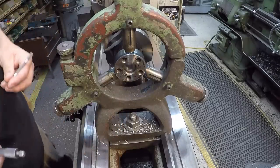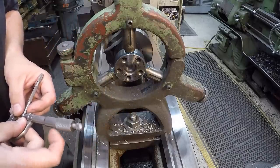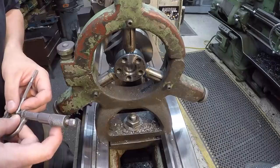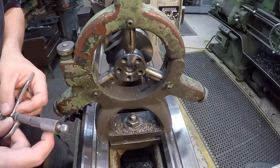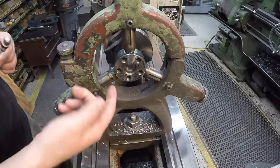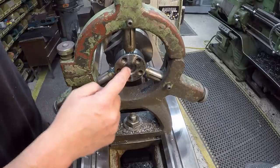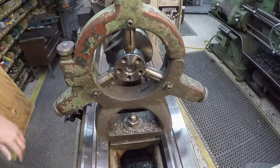We're just going to make it whatever depth I've got. I just used the scale again. It looks like it's 22 millimeters deep there. I kind of touched the back of the hole, so I probably went in there about 2 millimeters deep. So I'm around .832 right there. I'm probably going to call it 7/8 of an inch, probably bore it to about 0.875 inches. And if that looks good right there, we'll just leave it there.